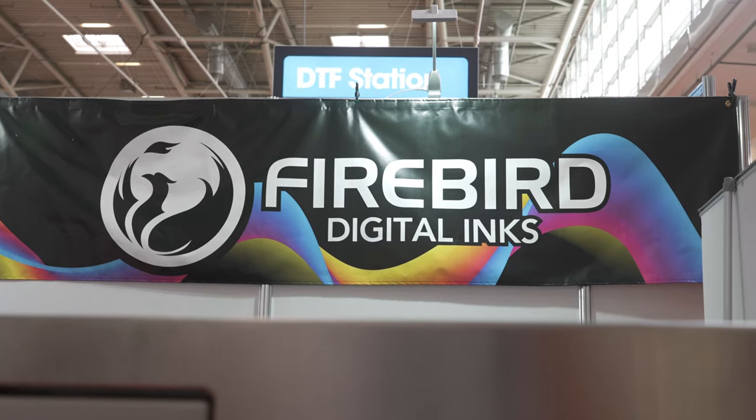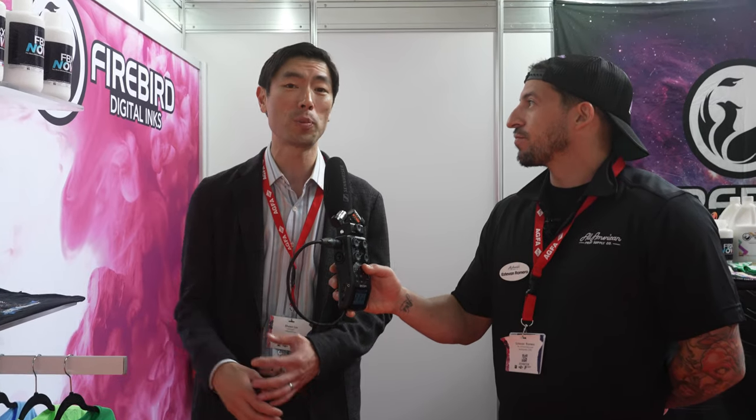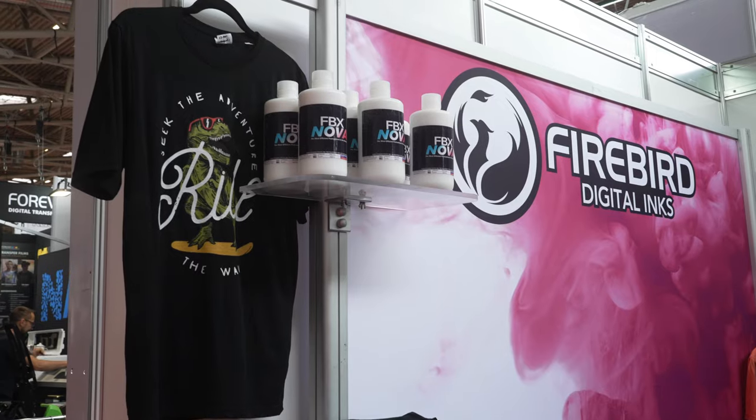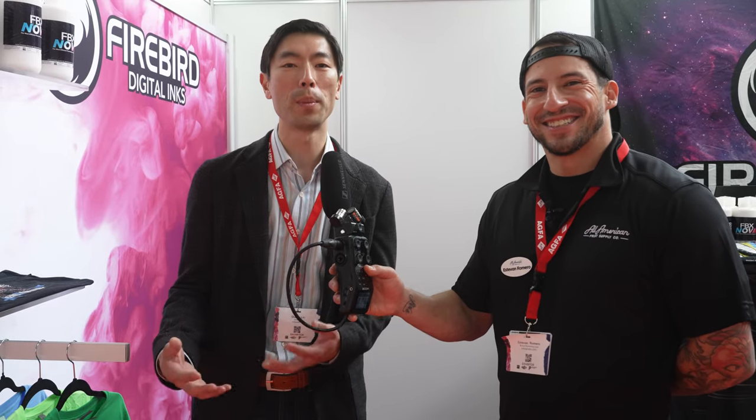You get our renowned support with All-American. We chose them as a partner because anytime you have questions — somebody may spray way too much and see some issues — but we're here to support and give you guidelines. The T-shirt matrix is something we developed that gives you a starting point for how much pretreat to apply, based on thousands of shirts we've tested. It's very complex and really a great starting point. Because if you're just diving into direct-to-garment, pretreat is probably the main learning curve — it's going to be the lifeblood of printing. We make it as easy as possible, and it's all about getting you the best quality product using the minimal amount.